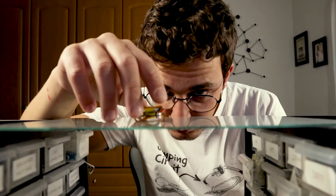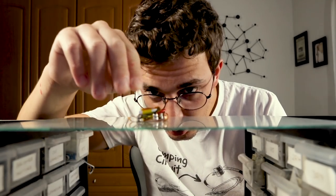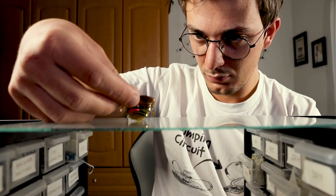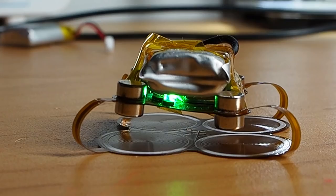Time for the jump. I think one of the coils is not working — only two coils are being powered because the other two are not hot. I have to dismantle it. I managed to dismantle the robot, fix the soldering issue and reassemble the whole thing. But once I mounted the magnets the same thing happened — one of the coils was not working. I disassembled it again and it happened again.